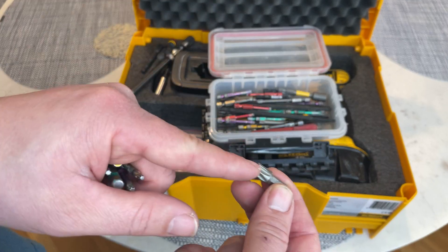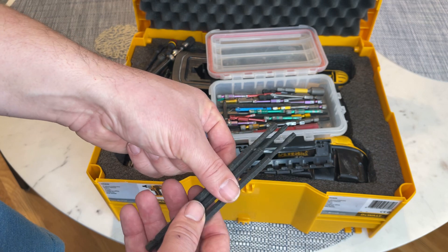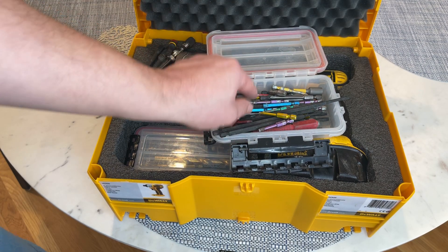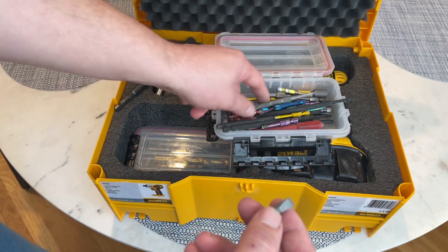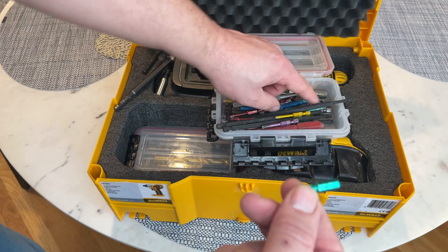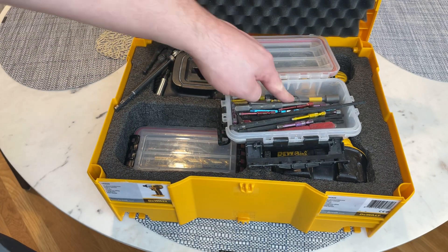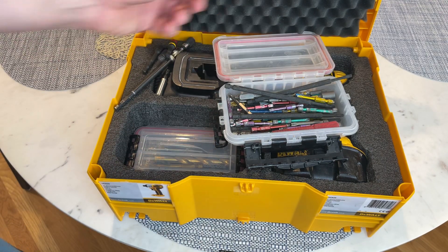When they get really big they don't change colors — this is a T50 for lag bolts. I also have extended versions for really deep spots where you can't get in there. I've got a punch and another punch because you always need those. I've got the obligatory slotted bit, and when you buy those kits they give you a little shorty T25, but I like to get my fingers around it without pinching, so I use a slightly larger one. I've also got the Bosch standard PH2 Phillips.